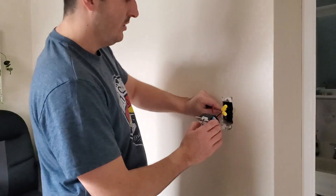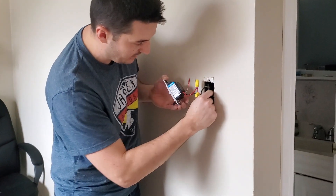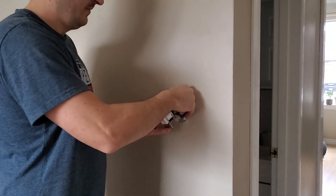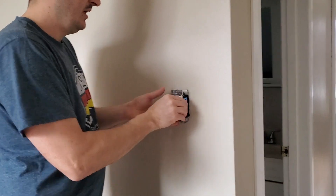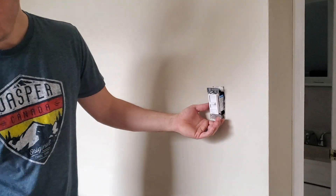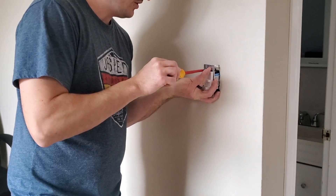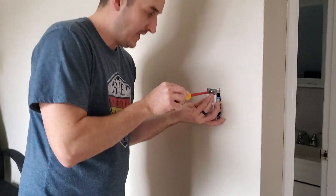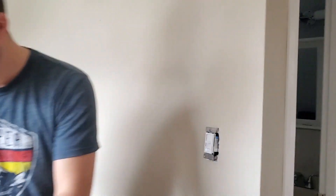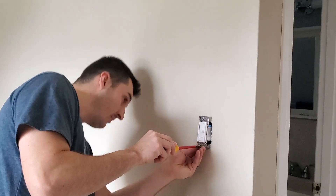Once in a while your switch will require a white wire, which I have in the back of this box here. My new dimmer doesn't require that, but sometimes yours will — it's called a neutral connection. More often than not with new switches, you'll have to make that connection as well. So put your white to white, your common or black wire — the feed — to the black wire; just try and match those up. Dimmers do come with instructions and they're usually very good at explaining what wire goes where, in case it's a little bit confusing.